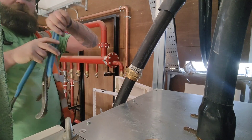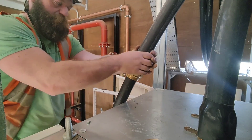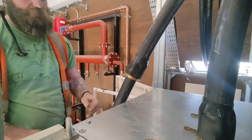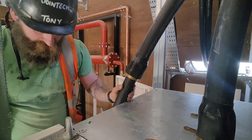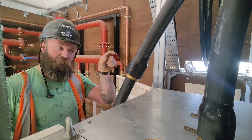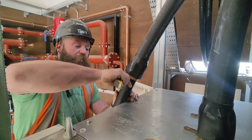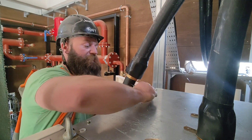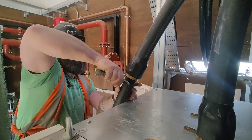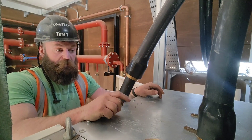She's tight. Shroud on — there we go, can't see anything popping up the back. One extra thing: no matter what size cable you're using, always ring it before you put it in, because if you don't, the cable could be at the back of the panel and then you've got to get a Stanley knife in and try to ring right round it, which always ends in tears — even if all you're doing is scoring it.